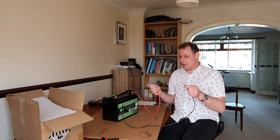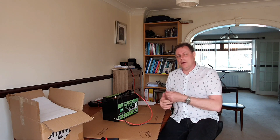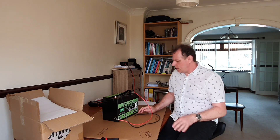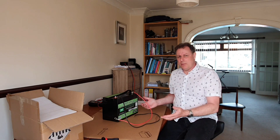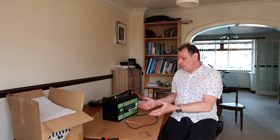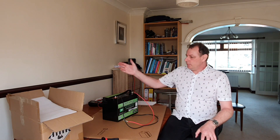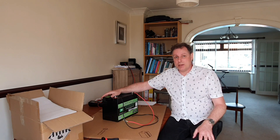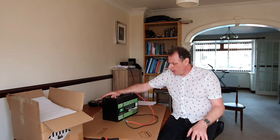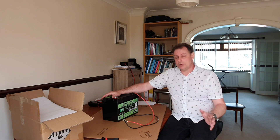It's reset itself. If that was a lead battery, you wouldn't be seeing that happen. We'd have a fire here basically — they would have welded together, this would all be melting and dripping off, and then there'd be molten metal everywhere. So there's all this business about a 30% state of charge, and yet it's got built-in short circuit protection, unlike a lead battery.